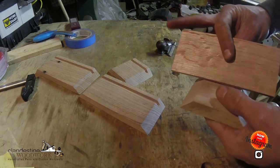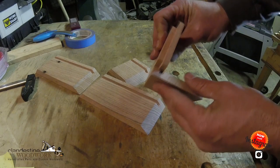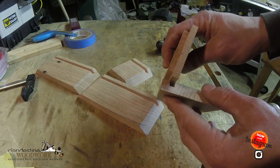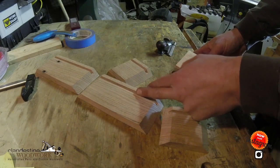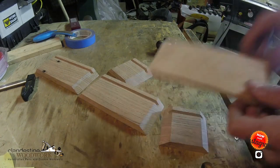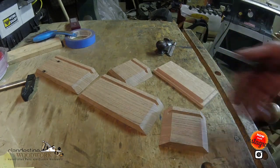My design has improved a lot, but I've got this piece here, and I'm trying to basically do a dado here in the back. And the issue is, this is a 1/8 inch cut with a spiral up cut bit on a router, and this is just eyeballed to be about 1/8 of an inch. Like I said, it was just eyeballed. So there's a couple different things we can do to make this fit.